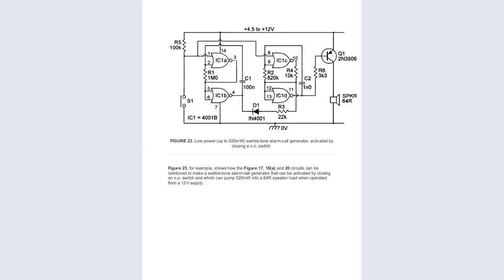You can imagine a doorbell where somebody is supposed to press at the door. Normally what happens? Somebody presses, it rings, it stops, isn't it? So the main thing that happens there is because of the push button bell. So when we want it to sound continuously without stop, the main thing that we do there is to include a relay. A relay creates something called a hold-on button. A hold-on button holds, instead of pushing the button and when you remove your finger it rings and stops. So the relay brings about the principle of holding. So the moment you press, the relay holds, it locks. That is normally in the alarms.